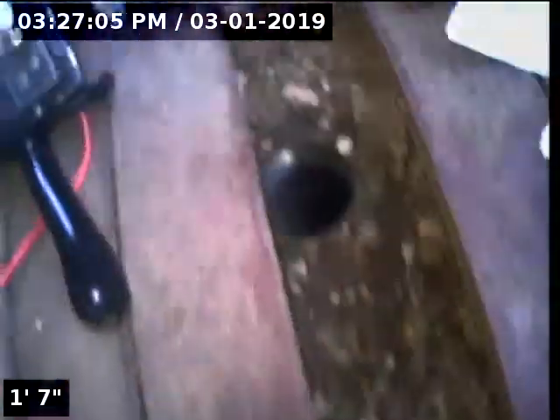The house is facing west. I'm here on the northeast side of the house. Here's your decking and your entryways in the back. The very corner of the house, inside the deck underneath a board, is a 4-inch ABS clean-out. This is where I'm going to access the line for inspection. I have water running from the kitchen sink.